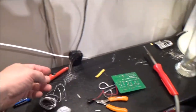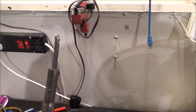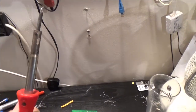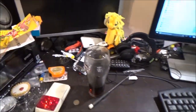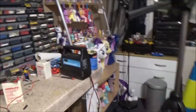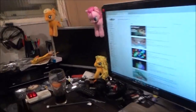But I actually find this combined with this, which is a decent soldering iron, it's got a decent tip on it. I could do with some more tips, like a pointed tip, because I've got to do drag soldering for one of the chips in there because it's surface mounted. I didn't realise that. If I'd known it had a surface mount chip in it, I wouldn't have got it. Well, that again was my own fault because I didn't look at the auction properly, so I can't blame the seller for that.